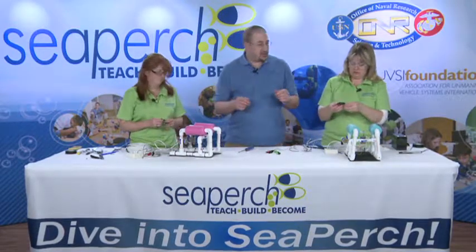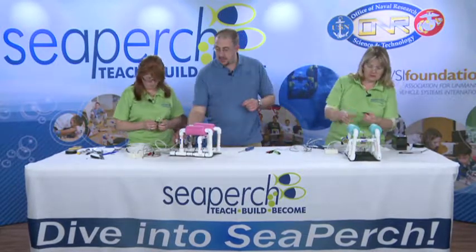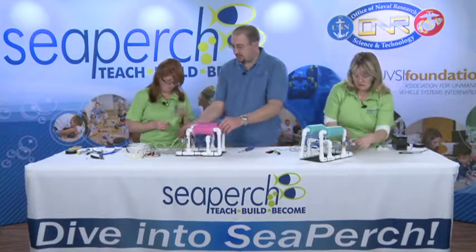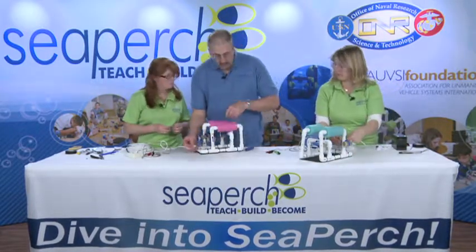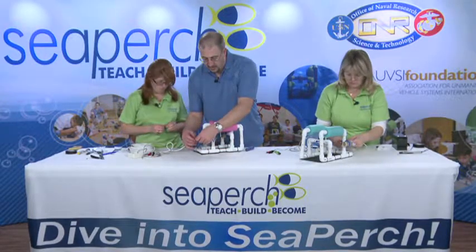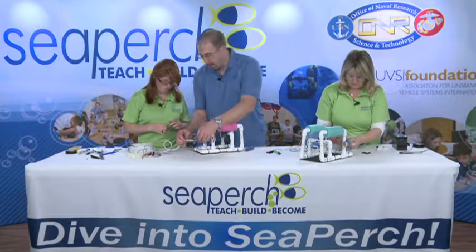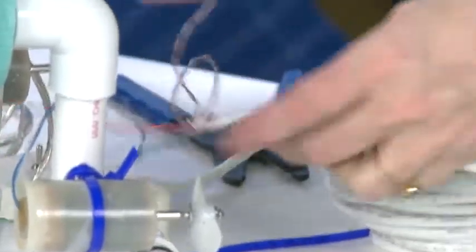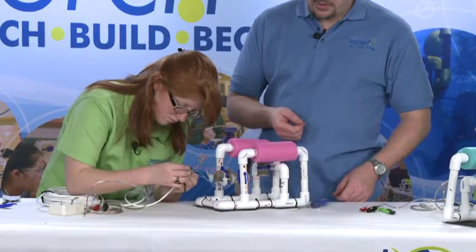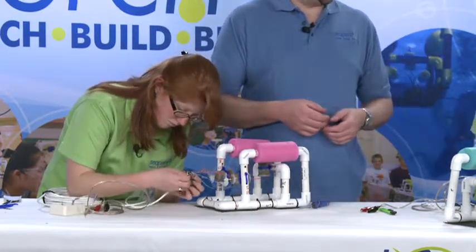You're going to work it in between each of the pairs of wires as they come out of your tether. For your brown wire, you can take it and wrap it around the tether itself, but you're still going to want to seal where it goes into the tether. Go ahead and wrap it around and through there, and then knead and work it in real well, because that's going to stop water from going up that tether and causing problems later.